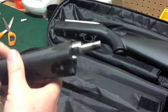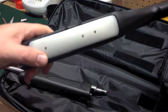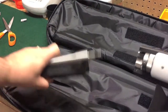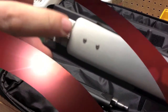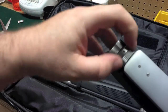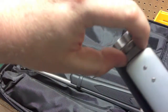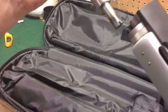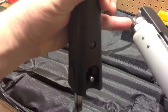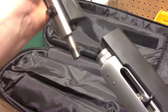You'll notice that this thing comes in two pieces — one here and one here. The trick to getting this thing apart and back together, very important, is this little deal right here. There is a little tension ring and you can hear it — it ratchets. As the action wears or anything else, you can ratchet that tension in and out. It moves this ring forward and back and actually increases the amount of tension.